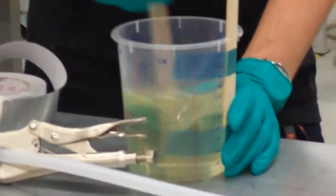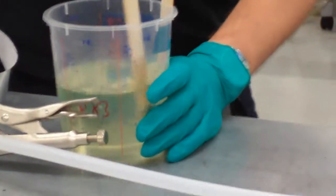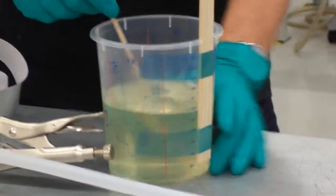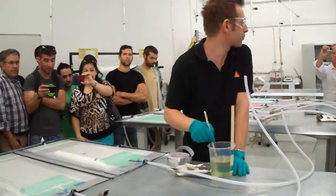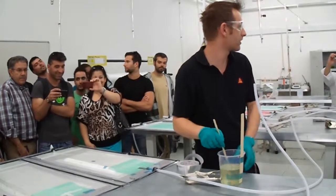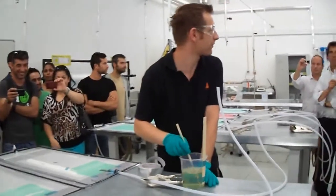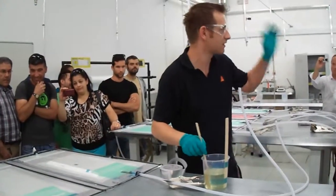You're working? Saying always: it can't be latex. Normally it's not latex, but latex nowadays ends up being permeable to epoxies, and he uses nitrile gloves. And I know some companies which are using 3 or 4 layers of latex, but I don't know if it's workable to do that. The protection is not as strong as if you're using nitrile, because the epoxy will go through the latex. This is known for several years from construction, because in construction for flooring there are a lot of systems available for many years.